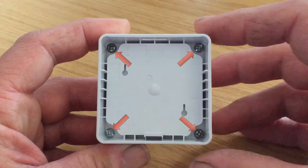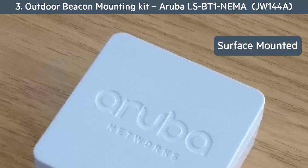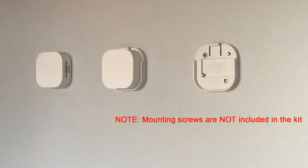We use the four screws provided in the kit to attach the lid to the main body of the enclosure. With the beacon securely located in the NEMA enclosure, we will now look at the two mounting options. For surface mounting the NEMA enclosure, we first take the included surface mounting plate, which is the same plate used in the indoor mounting kit, and fasten it using an appropriate fixing.